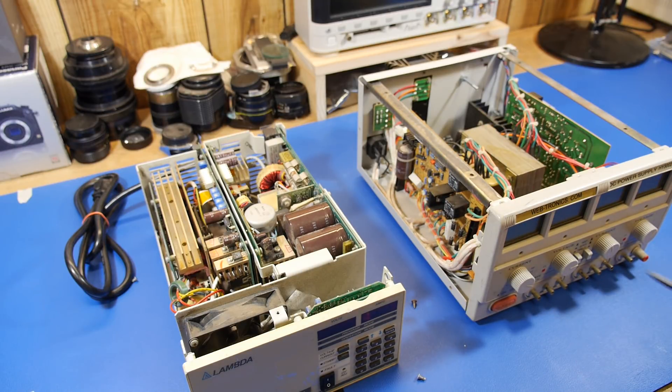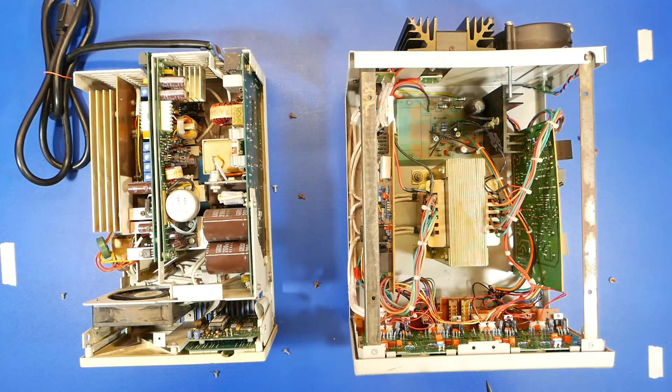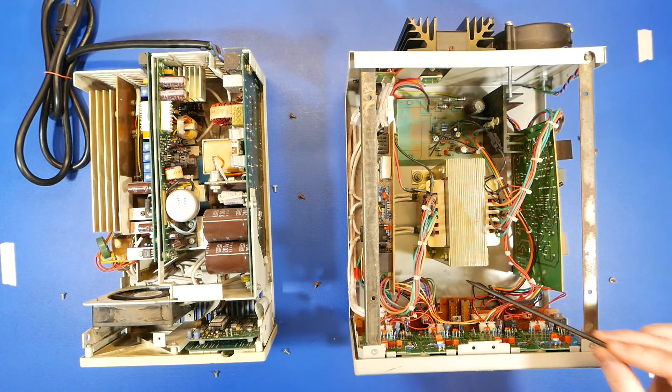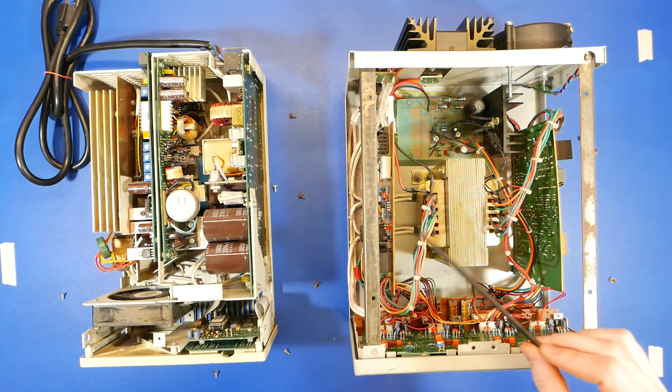With both power supplies out, let's take a look at the differences between a linear and switching power supply. In a linear power supply, you have your main input voltage fed through some filtering capacitors into a transformer, then into a bridge rectifier and voltage regulator along with op-amps and transistors. A key characteristic is having a large transformer that operates at around 50 or 60 Hz. This design uses a multiple-tap transformer — each output depends on a different turns ratio — so you can have 5, 10, or 15 volts AC, then rectified and adjusted using transistors and a linear regulator for less losses.